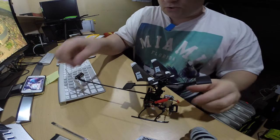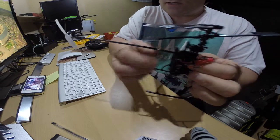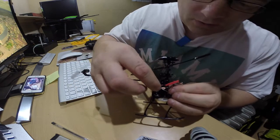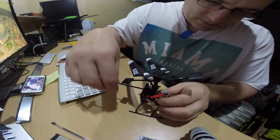I've pinned that now. Once you've got the new boom in there, make sure you've got it level and push it in real nice and tight so it's snug fitting, and then it should be fine. Reconnect the cable — make sure red to red, the right way around — and keep it nice and tight out of the way.